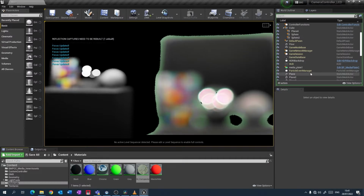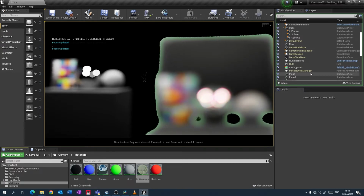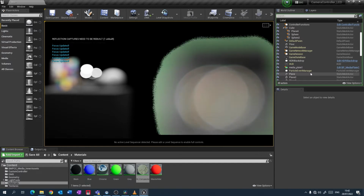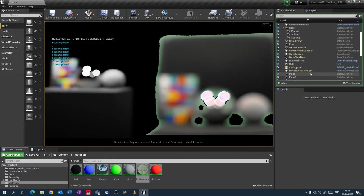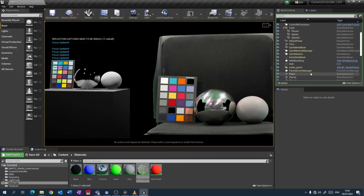From that, we've created a curve profile inside of Unreal Engine, and we've connected that to the lens focal distance. So when it's at a certain value on the potentiometer, that corresponds to a certain focal distance. That was a crucial part of calibrating the lens focus. There are some issues to do with the potentiometer or the camera drifting out of sequence. However, if you took it right back to 0 and then up to the maximum and then found the focal point slowly, you'd be fine with them matching pretty closely.